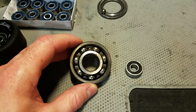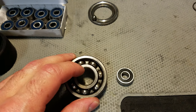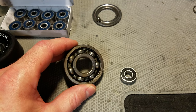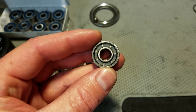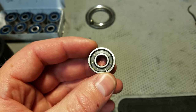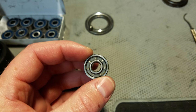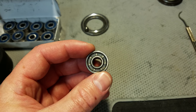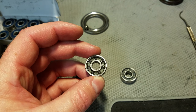The retaining mechanism that holds the balls in place and spaces them out is called the cage or retainer. Cages can be made of a bunch of different materials. Typically you see metal cages, but on precision skate bearings you typically see thermoplastic retainers. This is a Bones bearing — my understanding is the material varies by model, but visually this looks like nylon. Usually the material is either nylon, Delrin, which is another type of thermoplastic, or Teflon.